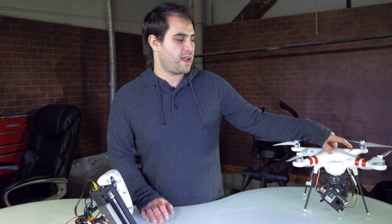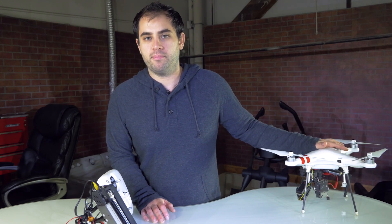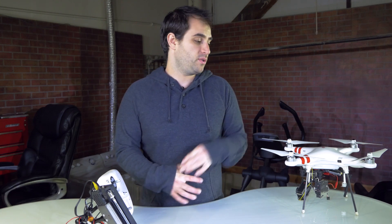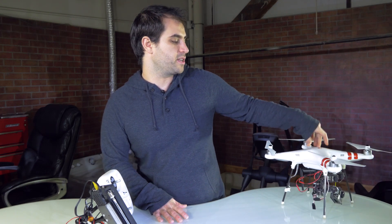There are a lot more features I haven't looked into yet, including the ability to plug in via USB directly into the IOSD and see detailed flight information on your computer — really helpful for setting up your Phantom and learning about how you're flying. I might do another USB mod on the other side to make that super easy. Definitely a great upgrade, and if you have a working FPV setup, I'd say the IOSD is a definite must.